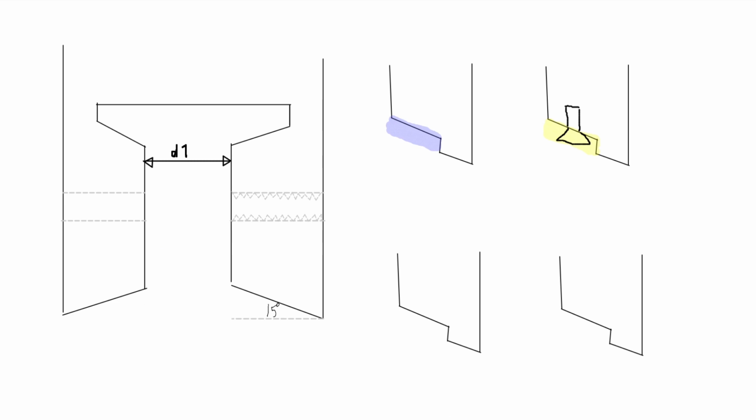It's very simple. You simply put the bolt in from the other side. Put it from this side. Oh, sorry. And it sticks out like so. And you put on the nut to protect the threads there. Then you just put a metal plate here, and now you can tighten up the bolt with a lot of force. This will push the jaws apart, and you push them apart too much, so that with the rebound they are back to being parallel to each other, more or less.